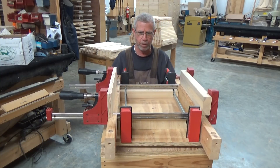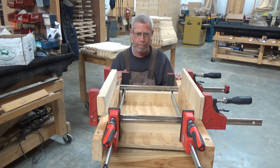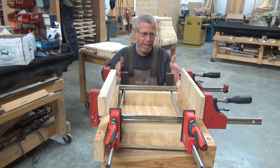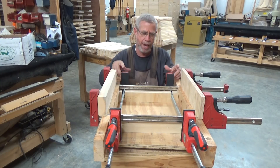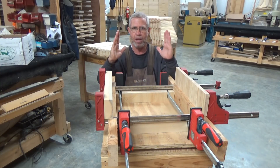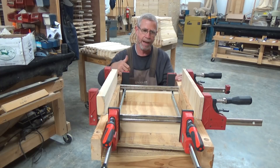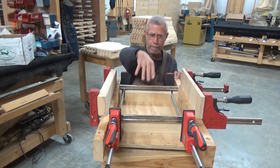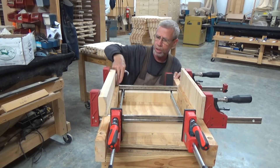What I've done is I've taken one of our little sanding stations. We've got these set up on lazy susans so they turn around and we can sand our tops and sides a lot easier. I just modified this one — by chance, these 2x4s right here were actually the right width for our boxes. I just had to put some spacer blocks in to make that work. I use the wide jaw clamps right here — they put pressure on a longer part of the box. I measured the box and cut the 2x4 material so the clamps sit inside it, and I cut grooves so the clamps are flush to the tops of the blocks.